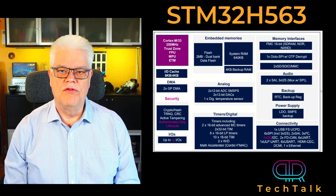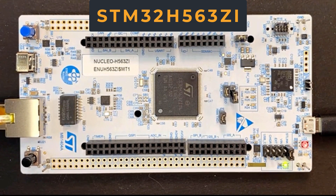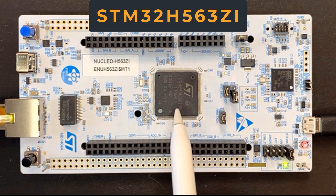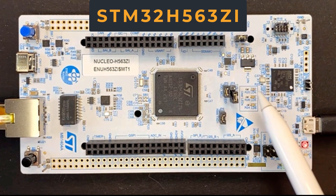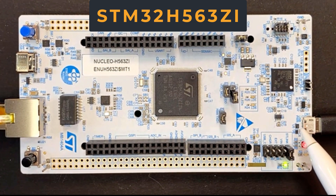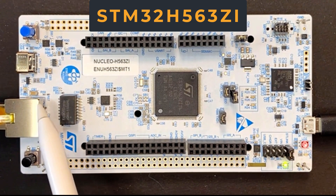Now that we have a better understanding of the MCU, let's take a look at the NUCLEO board. Here we have the STM32H5 NUCLEO 144-pin board, referenced as MB1404 or NUCLEO-H563ZI. There we have the microcontroller of the H5 itself. The microcontroller up here belongs to the ST-Link V3 interface. In my board — I think it's a pre-production board — there is a micro USB, but it will be a USB-C in production versions. Up here we also have a USB-C connector and an Ethernet connector with the magnetics.